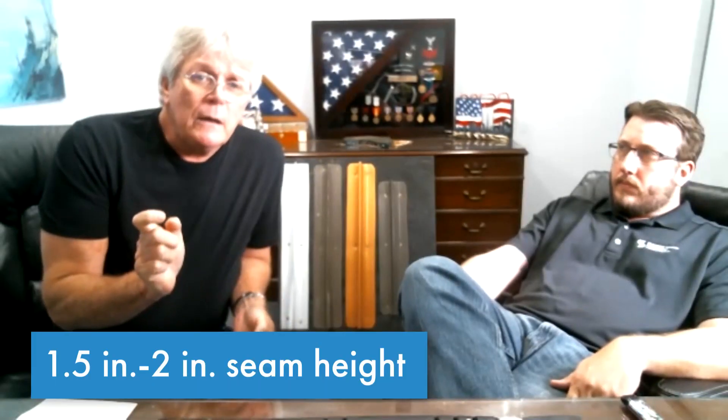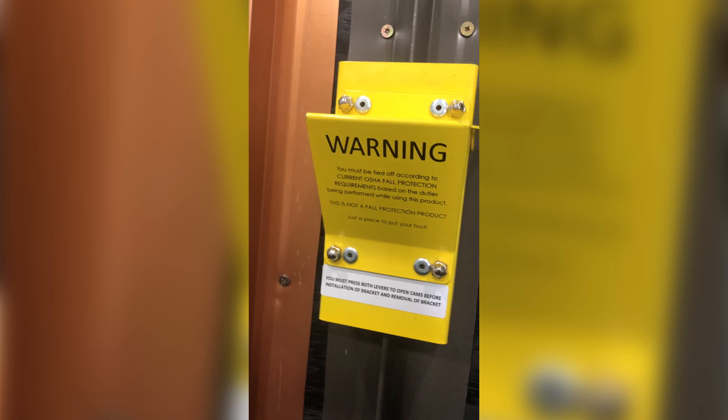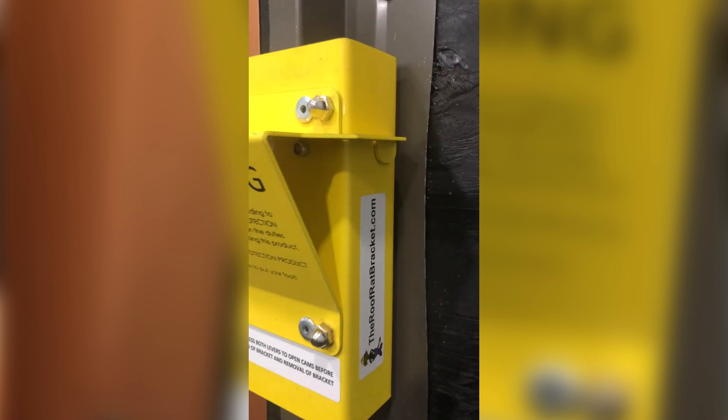So what type of profiles does it work on? Does it work on all profiles? It'll work on anything that's an inch and a half high up to a two inch — those are most of the panels used in the industry, so that's what it was designed around. It works on a two inch on a 90 or 180. You don't see a two inch on steep buildings very often unless it's government work. For Galvalume, it's a great product because Galvalume gets scuffed and you have to replace the panel — now you have a place to put your foot. Also on the bottom of the bracket, it has little rubber feet to protect the finished surface of the panel, so you don't have to worry about any metal surfaces touching the paint finish and potentially scratching it.